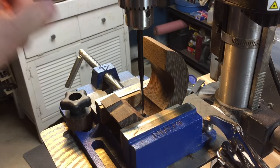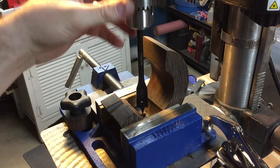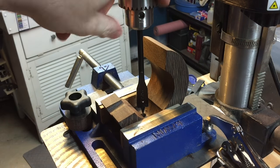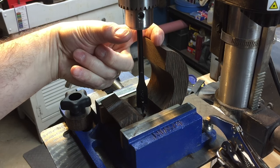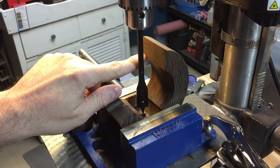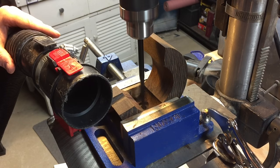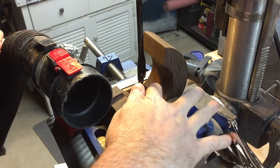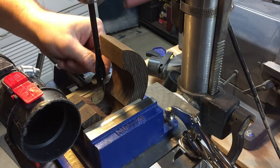Here I'm going to widen the rim of the cord hole to fit the rubber washer to a 5/8 inch, and I'm using a spade bit so I can clear the top portion of the ring so the drill press chuck doesn't hit that. You can also use a Forstner bit with an extension that would work too. Another option would be to drill a 5/8 inch hole all the way through before you would turn the ring and insert a thicker rubber plug.